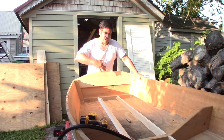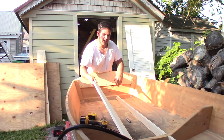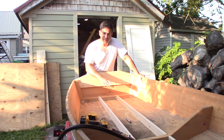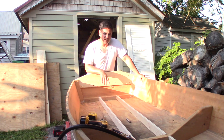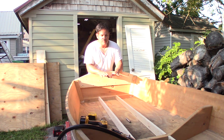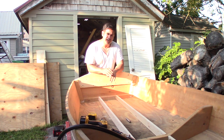In part 10, I'm going to show you how I'm making this tunnel in the bottom of the boat. Really the only purpose of it is to hold more flotation foam — it's actually insulation board that I'm using as flotation foam, just in case. The other purpose of this tunnel is to elevate the seating platform just above the floor so you have a little bit of leg room.